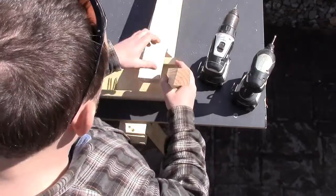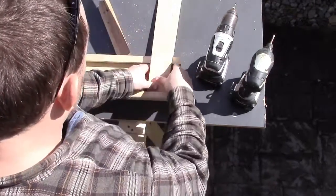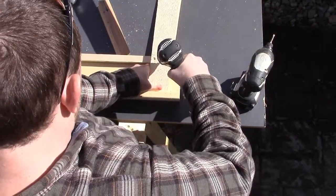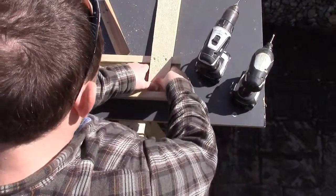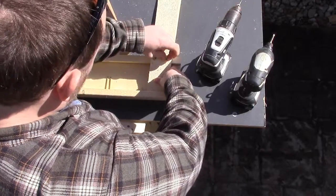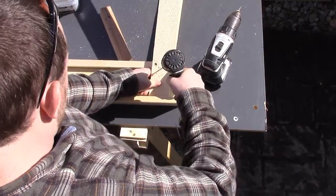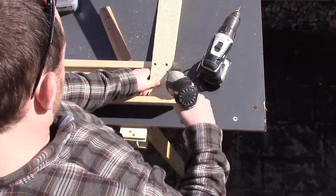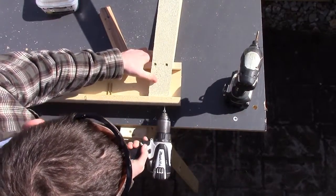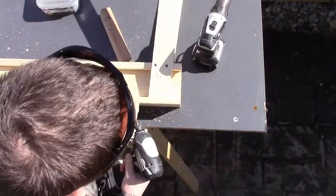Using a piece of scrap or something as a spacer, position a leg. Hold it firmly and drill 2 pilot holes as shown, so the screws will secure the leg to the beveled edge of the I-beam. Still holding the leg firmly, use your guide marks to drill 2 more holes into the top of the I-beam, at a slight angle to match the legs, and then fill the 2 holes with screws.